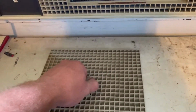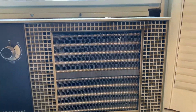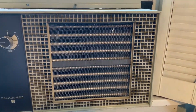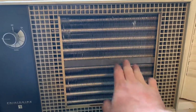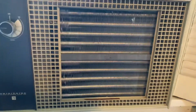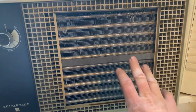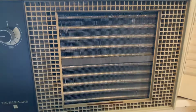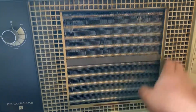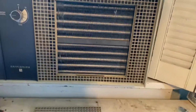Oh man, it's still pretty strong for its age. And this arguably is one of the coldest coils I've ever felt when it's running. Granted, it's not helping that right about here is low airflow. So what I'm thinking is I might take a piece of screening, come around the sides so it still breathes, but try to force a little extra air into the middle, because it'll freeze up a little bit around here, but all around here will be fine. Since it doesn't use a centrifugal or blower wheel, it uses a propeller.